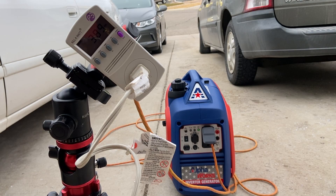The next test was at a quarter load, which I did by plugging in four 100-watt light bulbs. And here's something really weird: it ran for about 30 minutes longer with a small load on it than it did just idling, which I don't understand. I thought maybe I just messed up measuring gasoline, so I ran these two tests again and got identical results. So I guess it runs longer with a small load on it for some reason — beyond me as to why.